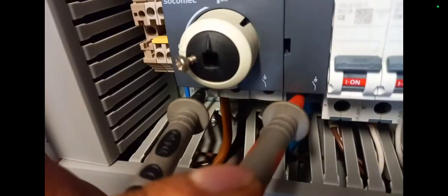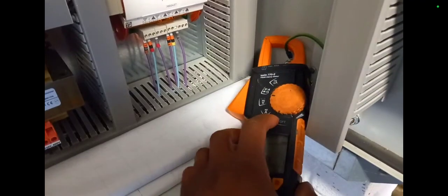Where's our neutral? Underneath here on the right. We've got neutral to earth — earth is still connected up there, so that one's done. Now we've just got neutral to line one, neutral to line two, and neutral to line three. I'm not doing safe isolation here — I'm just checking the voltage. When you're doing safe isolation and the power's off, you should be checking all of these. I can't turn the power off in this building. Neutral to line one: 240 volts. I've done neutral to line two and three, and we're done.